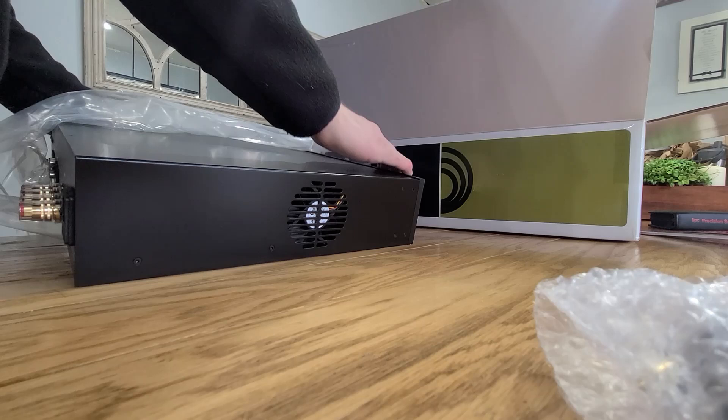Let's take a look at the measurement and zoom in on it. This is the measurement we just took with the Omni mic showing how the subwoofer is playing within the room. Ideally this would be a flat response — we designed it around an anechoically flat response — but you can see we're not getting that at all. As soon as you put a subwoofer in a room there are major interactions. We're seeing a 21 dB swing: the high point is around 20-something Hz at 105 dB, and the low point is around 84 dB.